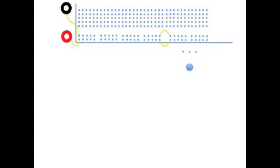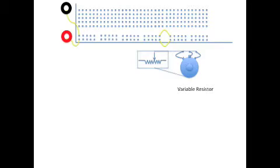We can use one of the two built-in variable resistors in order to provide a selectable voltage over a wide range. Above the knob used to adjust the setting for the resistor are 3 holes. These holes have electrical contacts to connect us to the slide wire on the resistor, as well as the 2 extreme ends of the same resistor.